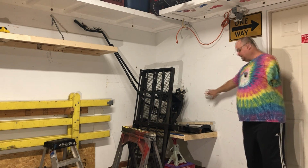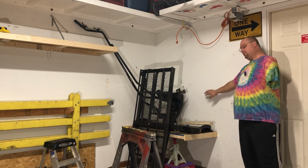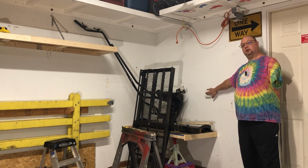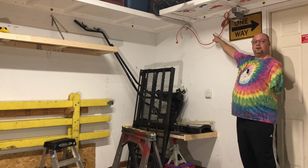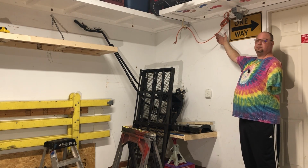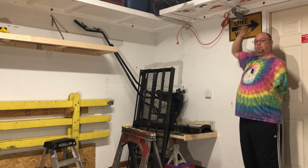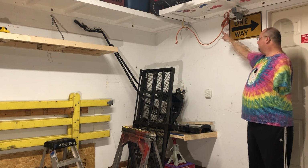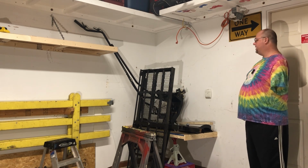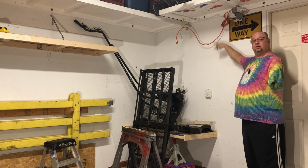I don't want to block this outlet, and I'm also going to, since I know the studs go vertical, cut this outlet out, another video, put a remodeler box in up here and run a drop down to here so that this motion sensor that I had made when I first moved in for the rope lights can just plug in up there, because the shelves are going to be in the way, and I don't want to drill a bunch of holes through the shelves just to get to an outlet. Why not just put a remodeler in and run another outlet up high?